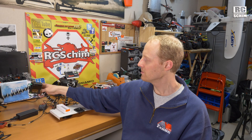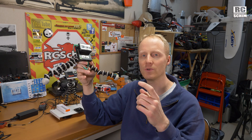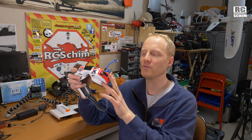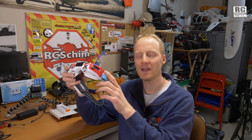And I also compare it to something that I used for years. This is the FR632. It was like 50 bucks — a diversity receiver that just takes two antenna signals and decides which image is better and takes that. So that's what we used until one or two years ago. RapidFire worked really well for me. These are the kinds of diversity modules that take both images, fuse them together, and reconstruct a working, flyable image.